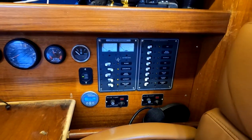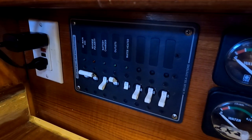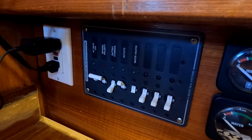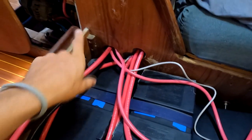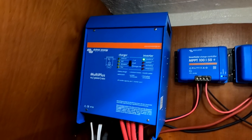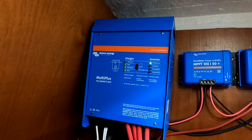Now the 12 volt is only one part of my electrical system. Another part, now added all in, is my 120 panel, which controls the 120 volt AC power on my sailboat. Going through the full system again: electricity comes in through my solar panels, through the MPPT solar charge controllers, which charge the batteries. Another set of cables goes over to my inverter — the Victron MultiPlus, a 3000 volt-amp, 120 amp inverter multi-plus — the top-of-the-line inverter you can get for a sailboat.